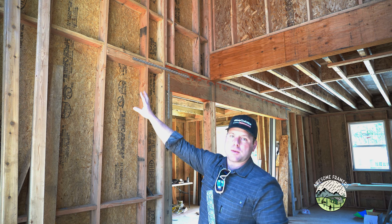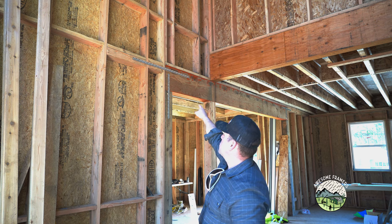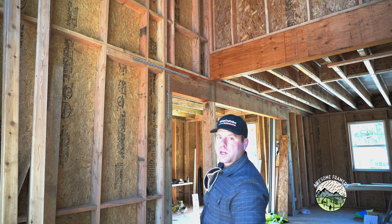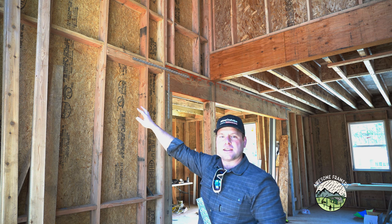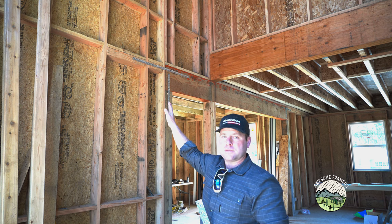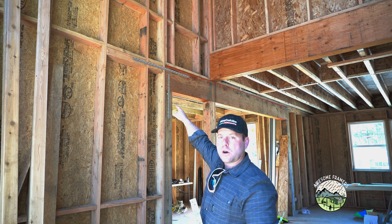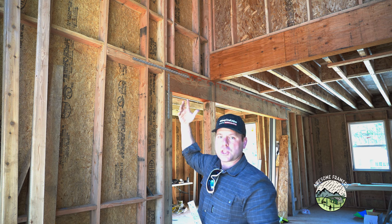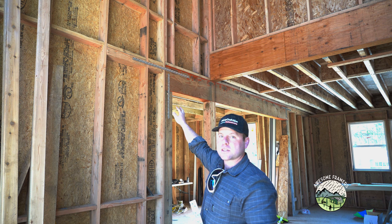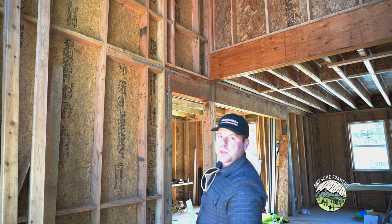Now I have a balloon-framed wall on this side because this is a two-story cathedral living room. Going front to back on the house, that LVL needs to transfer to the shear walls in the front and the shear walls here on the side. You can see we framed them just like normal headers. Then according to the engineering we have four-by-six blocks in the wall that on the opposite side get nailed with the sheeting. That strap has been sized — and the number of nails sized — so that this shear wall connects to that beam, which does the exact same thing on the front.